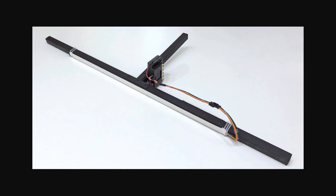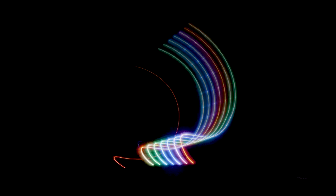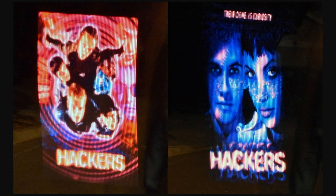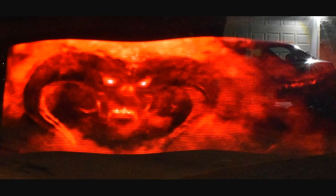Phil Burgess has also taken Clue to build this light painting stick. The idea behind light painting is pretty simple: if you keep a camera shutter open in a dark room, any light source will be captured as an unbroken line as it moves through space. What this project does is use a whole lot of lights in an array to allow you to display images or patterns in space. The code allows him to program the RGB LEDs using bitmaps, and he's using DotStar strips instead of NeoPixels for their higher polling rate. There's a lot of cool stuff in this project, and the results really speak for themselves.